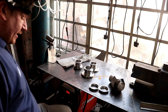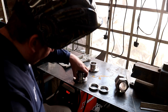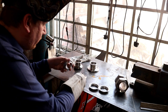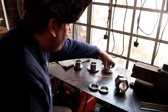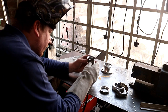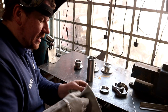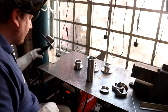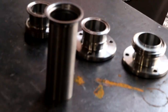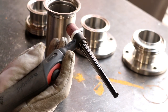So we're going to take it as it comes at the moment. We'll try, like I say, 65 and we'll see where that gets us. This is really thick steel as well, so I may have to up the current to get that actually welded on. So what I'll do, I'll start on the thinner stuff, and because we're on the thinner stuff, we should find it a little easier to start with a cold torch. Right, let's just get you guys repositioned, get you into a good position, get you zoomed in. Let's see if we can't get started.